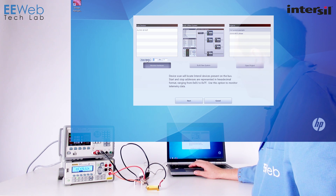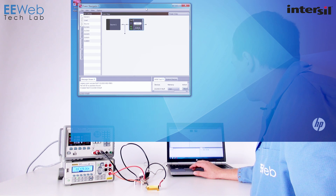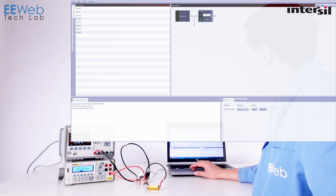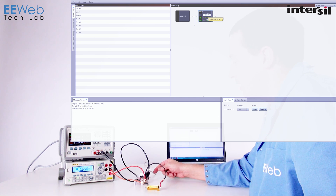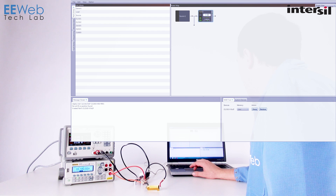It's at address 2F. Now it creates this project where I have an input to my ZL2102, and right now it's labeled as rail zero and it's running at 3.3 volts. One of the interesting things about these boards is they're all set up to daisy chain, so if I had multiples I could plug them all in and this one dongle would recognize all of them as long as they had separate addresses. You can see that the ZL2102 is reporting just a little over 3 amps of current.